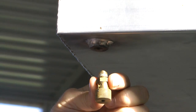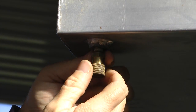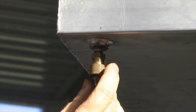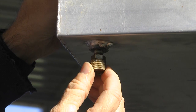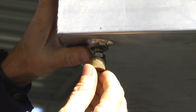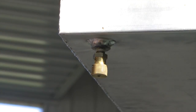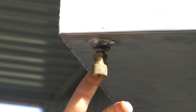Next we have a locking valve. This is either on or off depending on how you set it, and it also threads in. By pushing and rotating, the fuel will continue to evacuate until you turn it back off. This is perfect for draining the entire contents, such as at the end of a flying season or for other purposes.